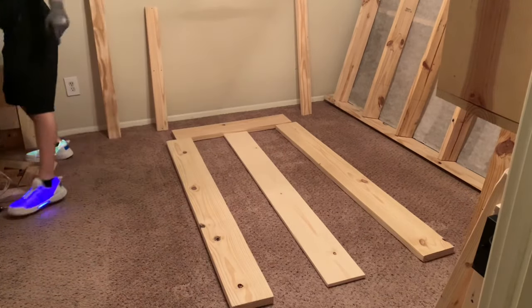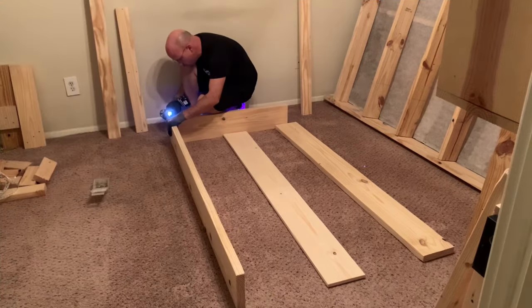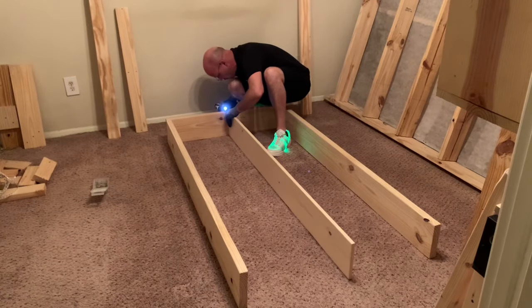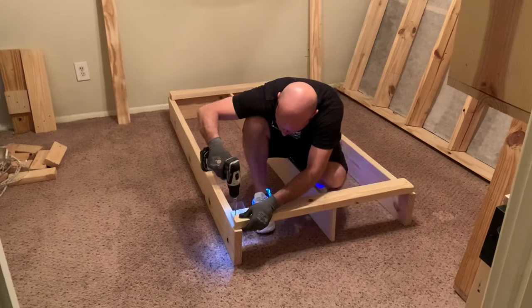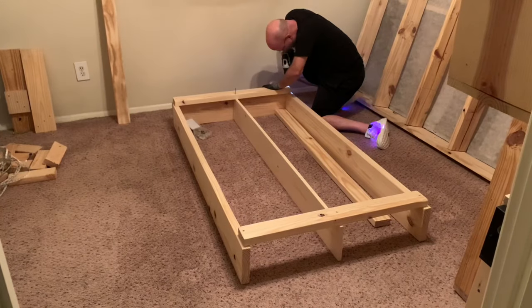It's super solid and with this video has lots of useful additions too. I'll get everything laid out and pause for a moment so you can see which boards I'm using for this step. I've already sanded down my boards and pre-drilled my holes so my build should be pretty time efficient. The 2x4s that sit on top of the 2x8s are shorter in length and width by about an inch compared to the 2x8s to allow a small space for the lights to sit.